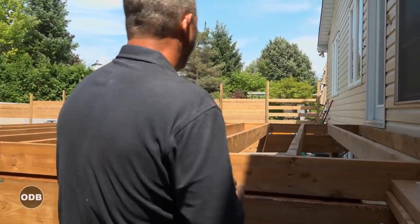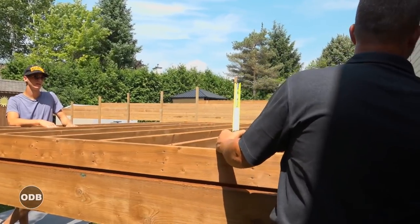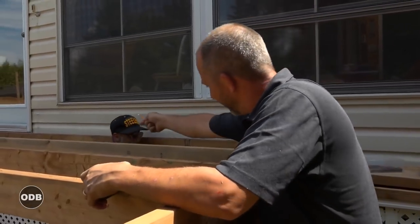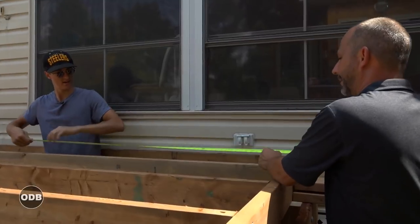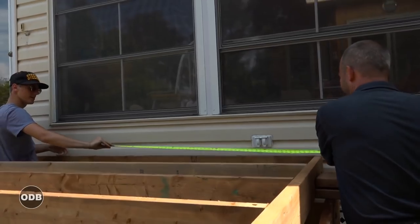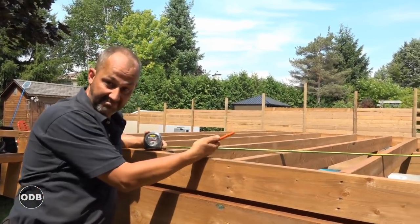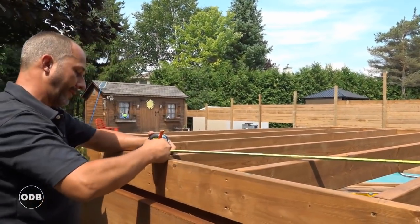The way that we measure this off — we're going to use basic triangle law. I need Nate to get in between these two joists about eight feet down. If I go three feet over and make a mark — actually we'll go six. So basic 3-4-5, or multiples thereof: we can go 6, 8, and then 10. In this environment, that makes it perfectly square. So we mark off our six feet, mark off our eight feet, and the diagonal should measure 10.